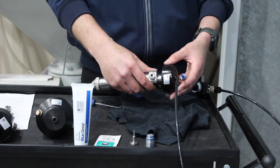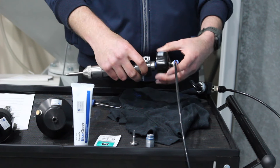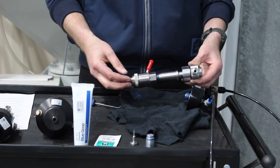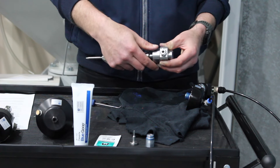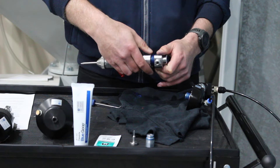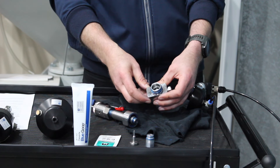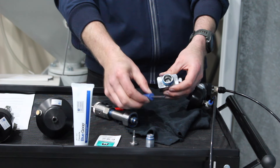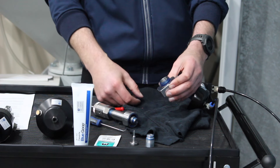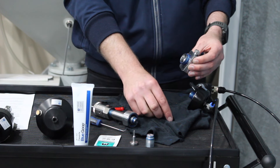Once we've undone that a couple of turns we can turn our air off as there is no chance of the needle and seat meeting. Once that's off we can then remove our nozzle body off the base of the valve body — undoing our nozzle nut and taking that out. In the base of our valve body we'll have a seat and an o-ring. We take our seal pick and being careful not to scratch any surfaces we just flip that out. This has been recently assembled so it's quite easy.